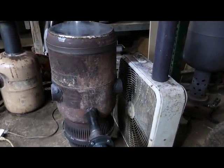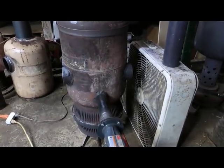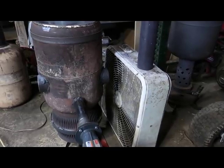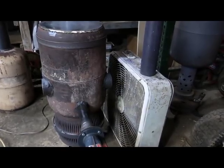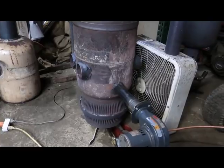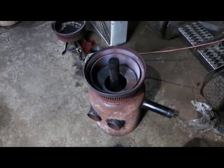I made the heat exchanger pipes so they sit underneath, so the fan blows through them. I wanted to put them above the center ring but had to put them below, otherwise I'd need a separate blower. These pipes are made from a gas water heater — inside that water heater is a chimney that's 3-inch pipe, about 1/8-inch thick, which is awesome pipe. I cut it up and easily got three lengths, but with the blower tube going in, I couldn't squeeze a third pipe in below it, so I settled on two.